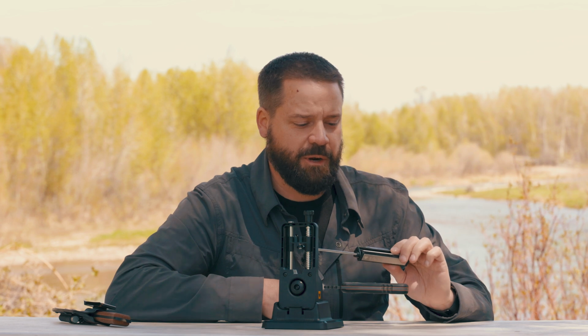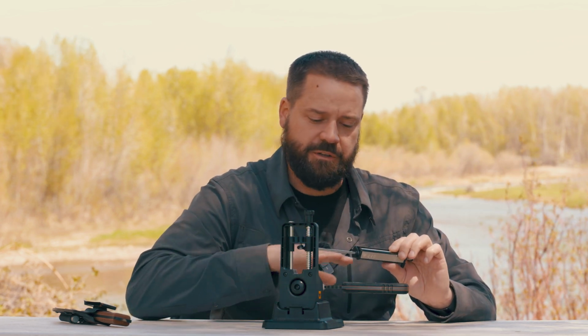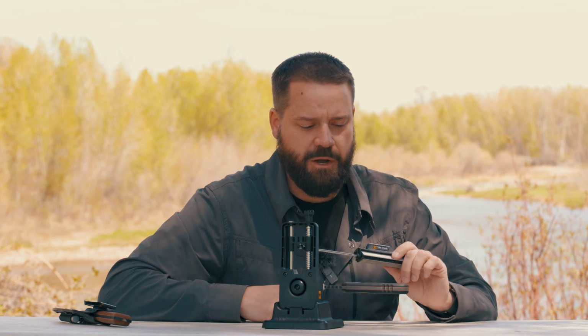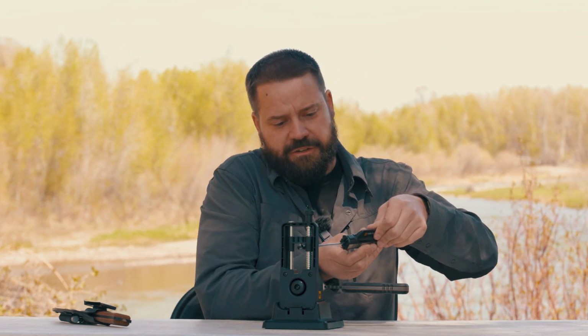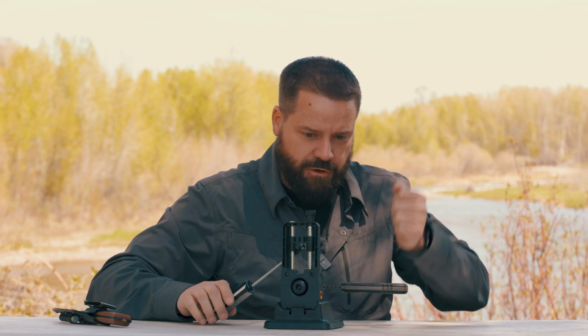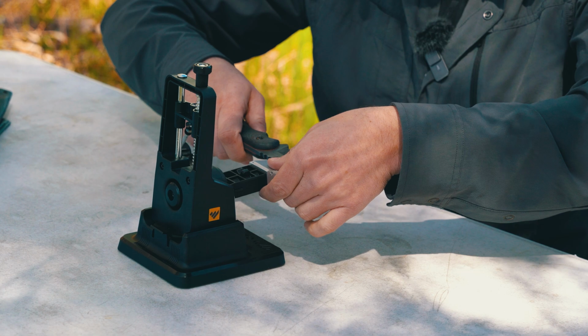If you kept pretty light pressure, then once you switch to the 600 grit, for the most part, you should be able to just do it a couple of times on each side, maybe 3 times on each side, and then you'd be ready to switch right to the ceramic. So we'll probably have to go a little bit further with the 600 just because we did so many passes with the 320. But again, it's just another reason not to overdo it with the pressure. You gotta let the tool do the work, not your weight. So, switch back to our starting side.